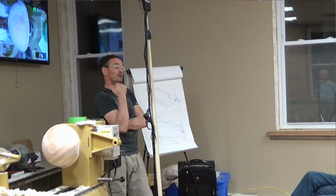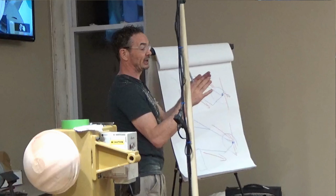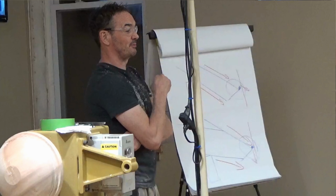It's the burr, it's magical. Remember, I had to keep going back to the grinder 3 times. But look at the result I got. I ended up taking out all my gouge marks, bringing it back to true. I was able to work it super thin, and I didn't blow it up. Even with my gouge, I'd been pushing my luck at that point. It's thin enough. And that's negative rake scraping.